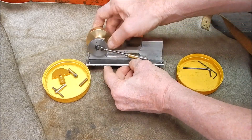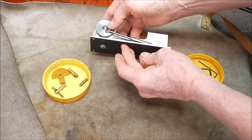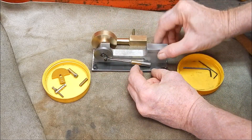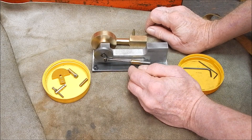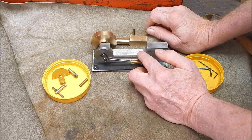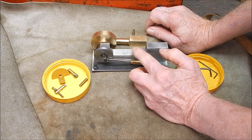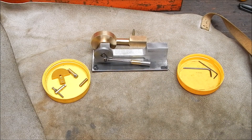The wooden base will cover up the screw heads. I used two different size screws because the thread stripped out on the first one — home-cast aluminium can be a bastard of stuff to tap a thread into with small sizes. If you ever tap a thread in home-cast aluminium or any aluminium, you really want to do it dry. As soon as you put lube on, the tap can start skipping and chew out the threads rather than get a good purchase.